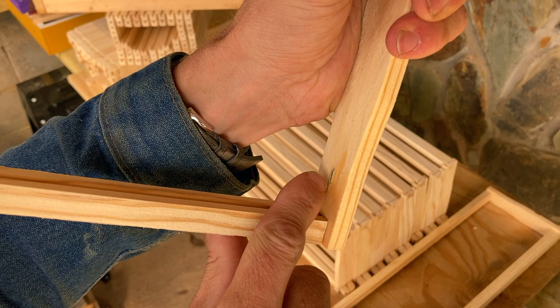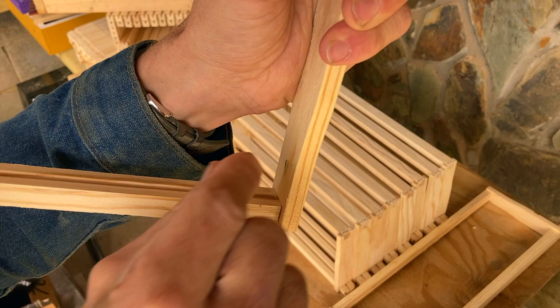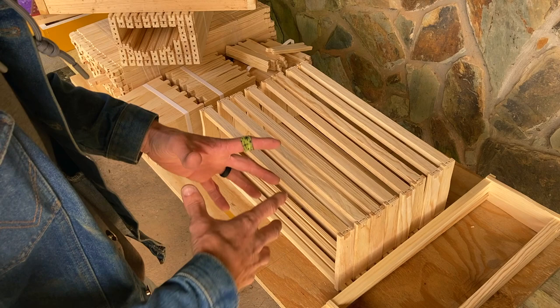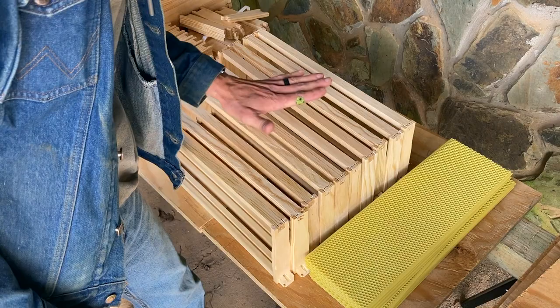One of my staples came out the side a little bit — I'll leave it since it didn't come out a lot. If it came out a lot, you'd want to take pliers and twist it back and forth until the thin metal breaks off, or take a small grinder to it. Another option: if you've got a tap hammer, put the frame on a hard surface and tap the staple back in. Now we're going to reset the workspace and get our plastic inserts ready.